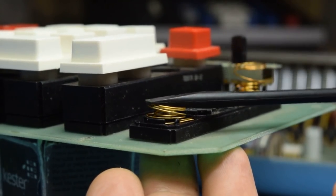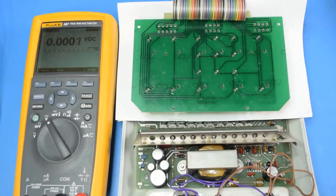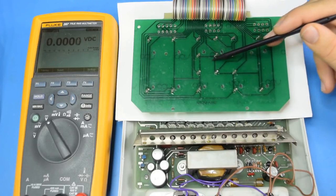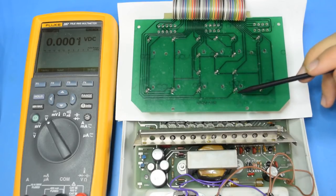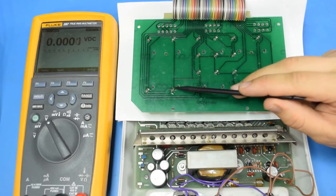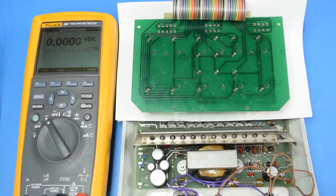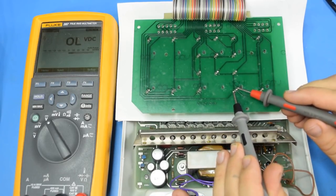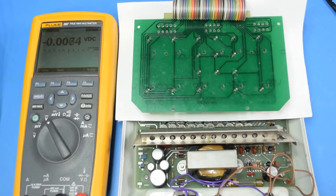That's different. Since it seems like the keys are being pressed multiple times, I'm starting to suspect the debounce circuit isn't working. So I'm trying to figure out how all the keys are wired, and it looks like they're not matrixed. Instead, there's one long trace that connects one side of each key, and they all have separate outputs going to the ribbon cable. If I measure the voltage across the keys while the unit's on, I get a reading of around 11 volts.